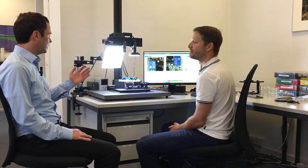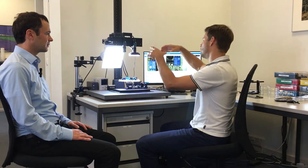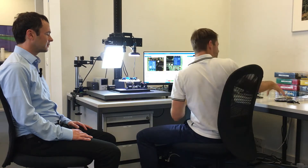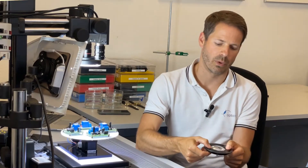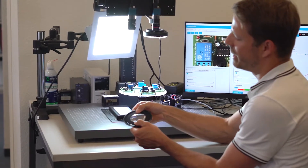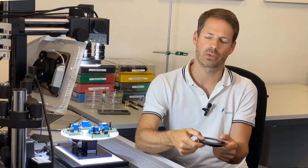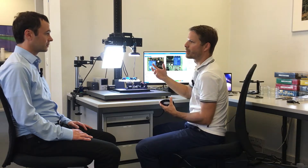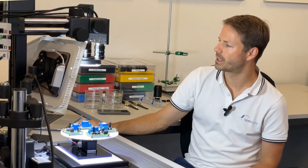How is the liquid lens controlled? The liquid lens is current controlled — when you increase the current you push a coil down onto the lens. What I can show with this larger demo is when we press down, this is how the lens is actually shaped. In an electrically tunable lens, this is done with a voice coil actuator. The more current goes to the voice coil, the more it pushes down, the more the lens flexes — that's essentially what we're doing when we move the focus.